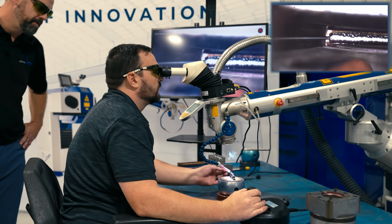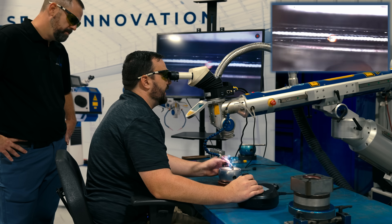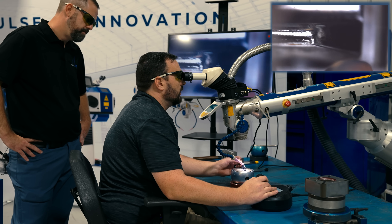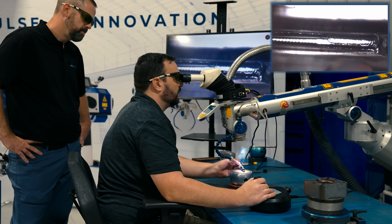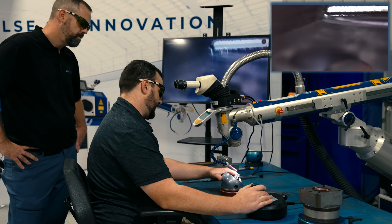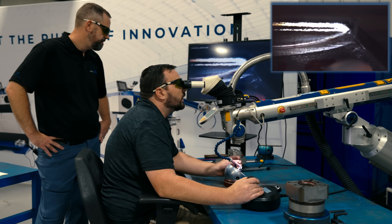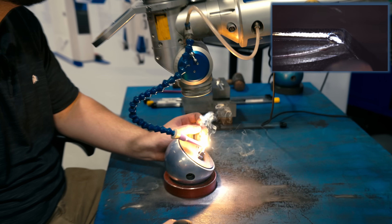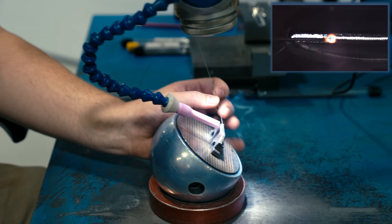What diameter welding rod are you using? I am using 20 thousandths. So if I know I need 15 thousandths on here and I'm using 20 thousandths wire, I'm only getting 10 per pass. So I'm going to want to give them at least two passes, but a third one just for safe measure. Once I have that done, I'm going to roll the ball and do the edge. Capping the edge just ensures you have a sharp corner.